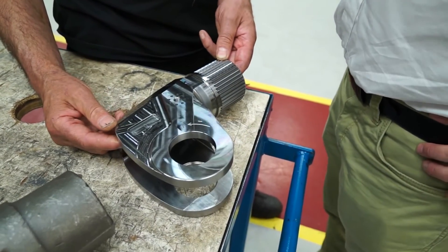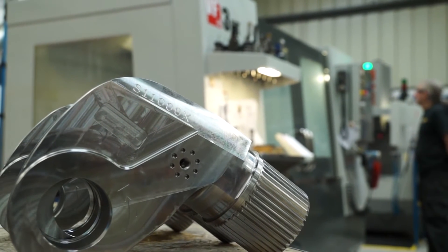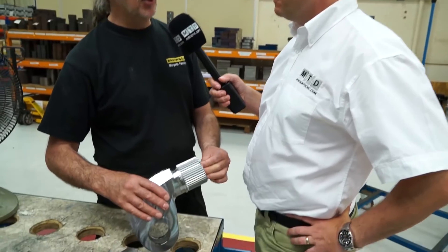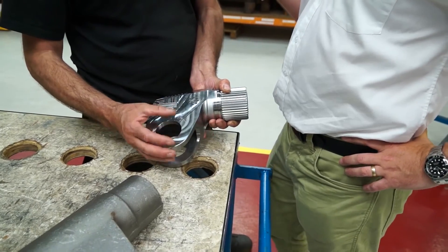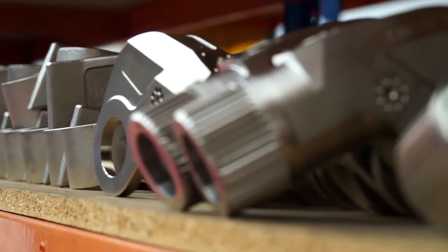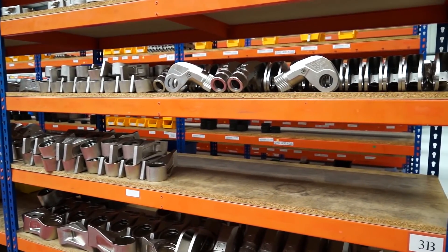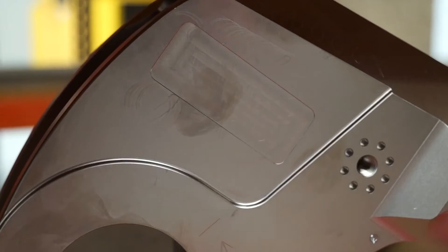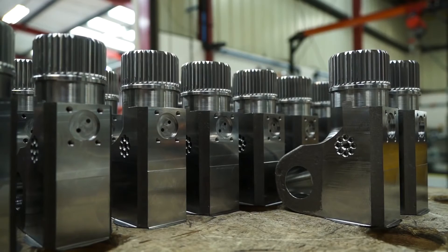Big question — what actually is it? This is the latest version of the 11000S series, the S11000X. It's been on the market for about a year. It's a hydraulic torque wrench body — all the internals fit inside here, the crank and the square drive fits in here. This is the basic cylinder that torques the nuts. There are some minor components subcontracted out that fit inside here. We do one bigger than this and then go down to really small ones.